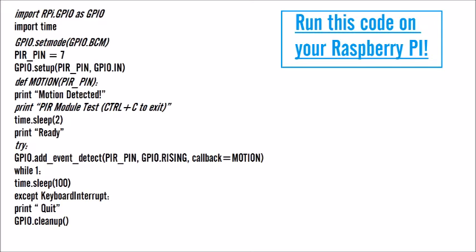We add some text so the user knows it's ready to detect movement. You could leave this out if you want, but it will print 'PIR module test', then wait two seconds, then print 'ready'. Now we check the input status of the PIR, using a while True infinite loop: if GPIO.input PIR pin is sending voltage, print 'motion detected' and wait for a second. The code continuously checks the PIR pin input and prints a line of text if the input goes high.